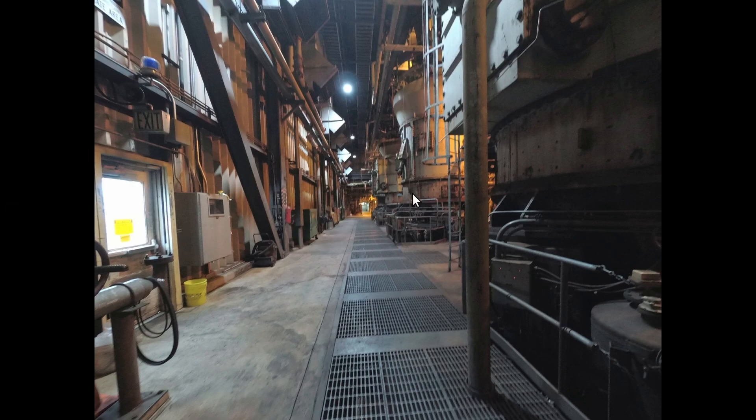Another picture of that same side. You can see the pyrite pit — a little indicator light tells you the position of the sluice valves and water inlet valves. There's a flop gate on these that has to be open when the mill is running. When you sluice, it closes and pulls out any gravel. They can get quite a bit of gravel built up, depending on what's coming into the plant. It can be almost a continuous job if you have really bad coal with a lot of gravel mixed in.